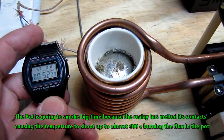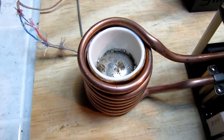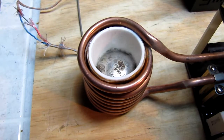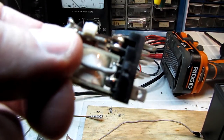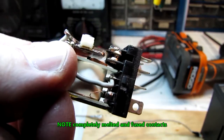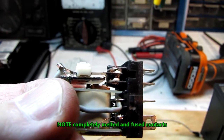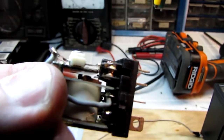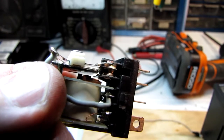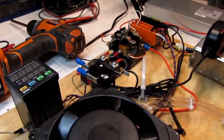My relay just cooked. About 45 seconds the pot was fully molten, but unfortunately that relay rated supposedly at 10 amps per contact didn't handle the current. Here's what happens when you don't account for the fact you're running DC instead of AC across the contacts — you have to derate relay contacts significantly at DC. These were supposed to be 10 amps a piece, 20 amps total, and you can see the contacts are just totally melted — the silver has completely fused across all three sections. That's history.